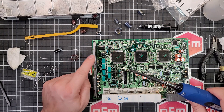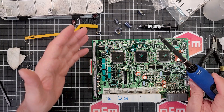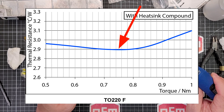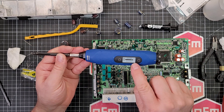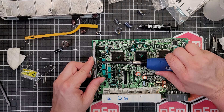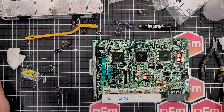One thing that's important with these TO220 packages - these are actually TO220Fs, which means the tab is encased in plastic - is the torque on the screw. If you look on screen you'll see a graph there showing about 0.75Nm or 75cm·N as the optimum. If you go too tight you actually lose thermal conductivity. So I've got my torque screwdriver here set to 75cm·N, and if I tighten that up until it goes click, that's perfect. So I'll continue with all the rest and we should be sweet.